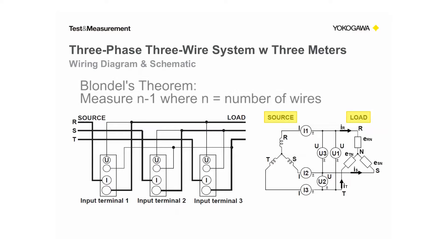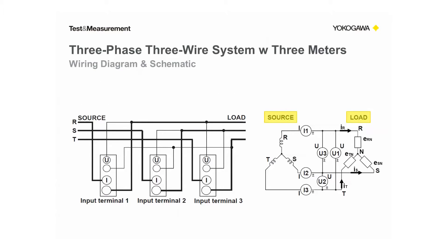Generally speaking, when measuring three-phase power the first inclination would be to use three wattmeters because we do have three phases. However, Blondel's theorem states that we can measure power using n minus one meters, where n is the number of wires. So for three wires, n minus one is two wattmeters. However, in this example I'll use three meters and explain the advantages. If you want the overall best power metering solution for a three-wire system, this is probably it — three wattmeters on three wires. It takes a little more effort to set up, but it is usually worth it.